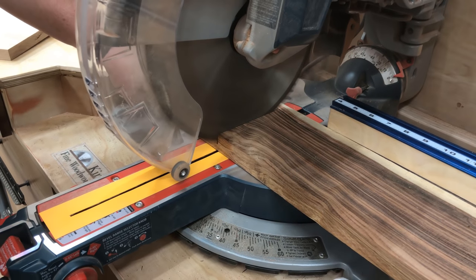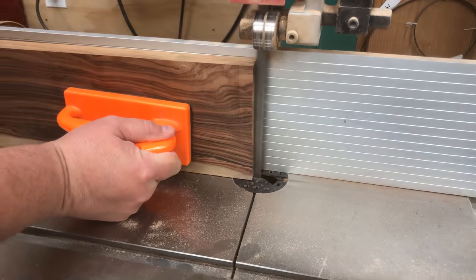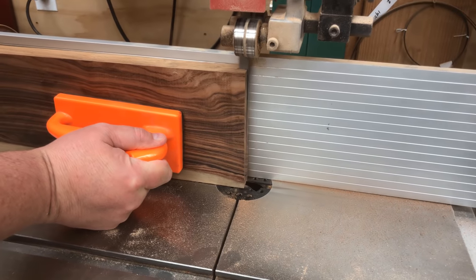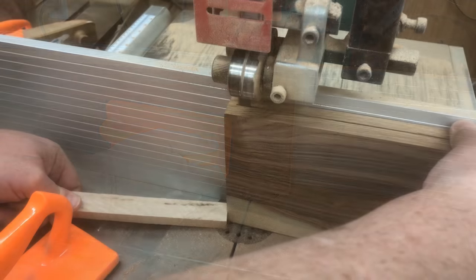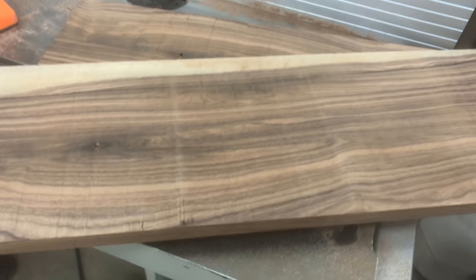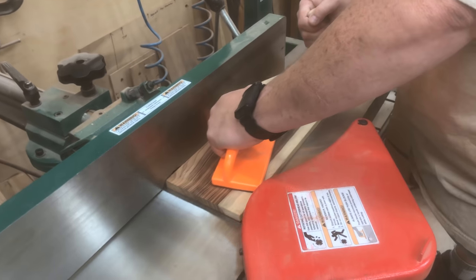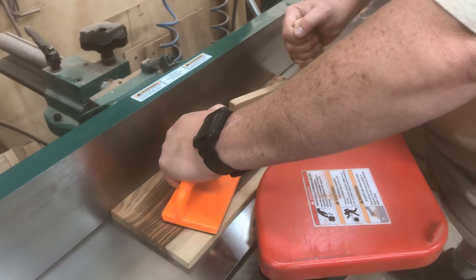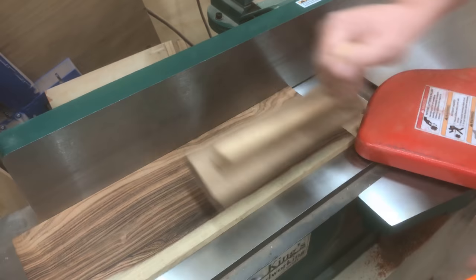For the next step, I'm going to make this push block a little bit wider. As it stands, that three-quarter inch piece of wood is not really wide enough — it tends to rock back and forth left to right as I'm pushing pieces through, especially with downward force. So I'm going to widen it by adding another three-quarters of an inch. I'm going to use this piece of Morado — also called Bolivian Rosewood or Pauferro — a fairly common exotic that's very beautiful when finished.